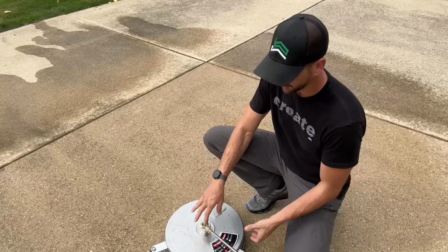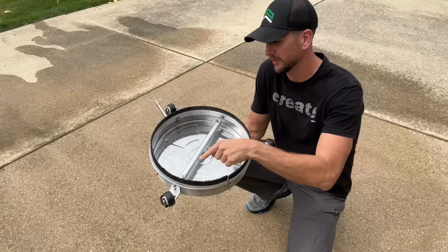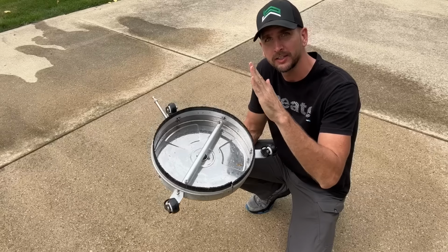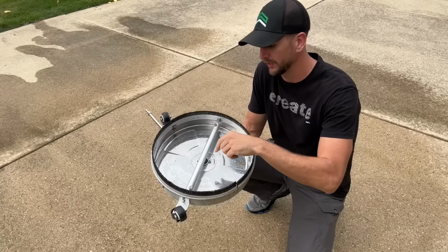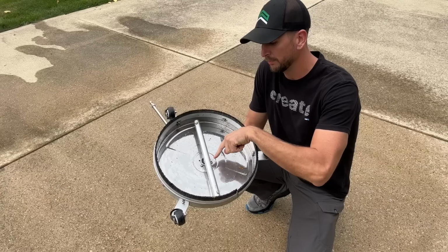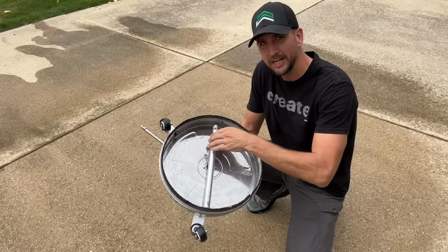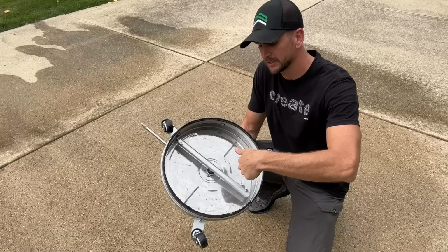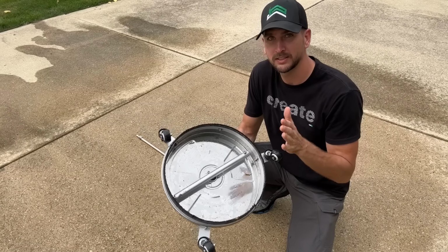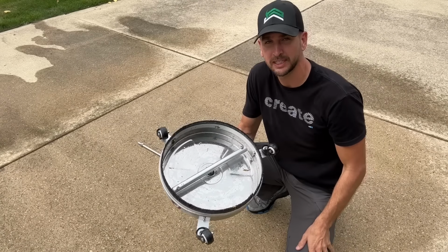So what's actually going on with this surface cleaner is it has 2 different tips here that are slightly angled to the surface, and it's on a bar that will rotate, and then the water can pass through this rotation joint. So since the nozzles are angled, they will actually spin themselves, and it's really effective in cleaning whether it's a deck or perfect for concrete driveways and sidewalks.